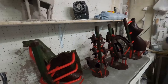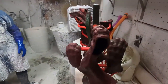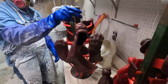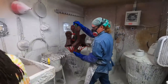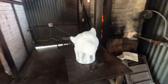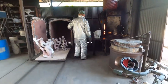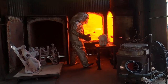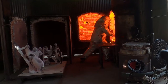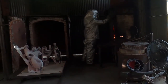The piece goes up on a shelf to dry — probably about two layers a day — and will be built up to about a half inch thick. It will air dry and cure as hard as a dinner plate. All the other pieces you see, like the feet, will undergo the same process, invested into the liquid ceramic just like the head. Here's the head after about three weeks — you can see the thick ceramic casing around the wax.